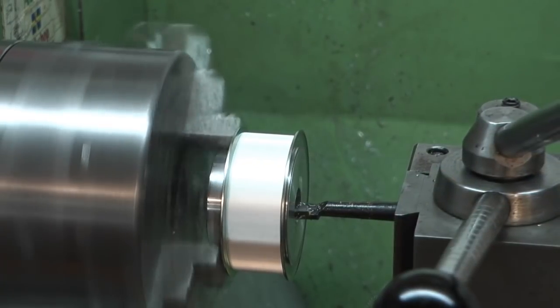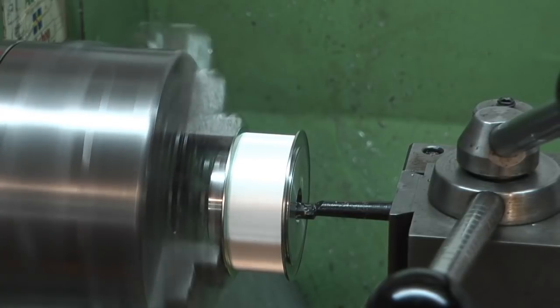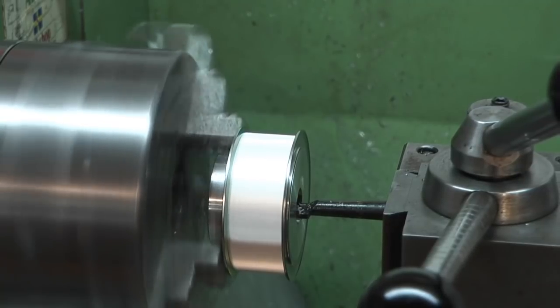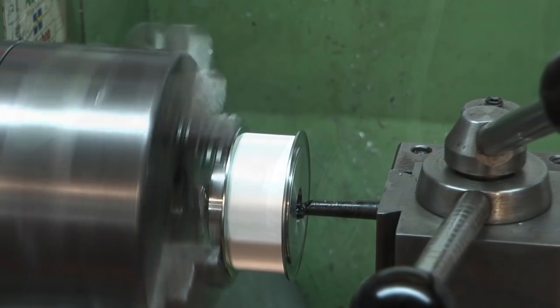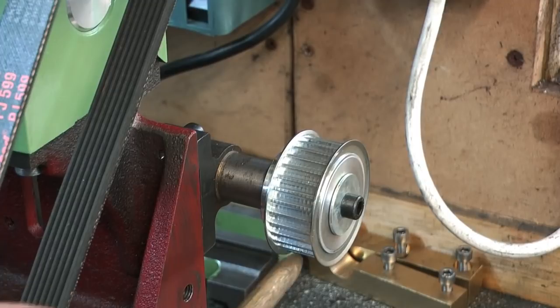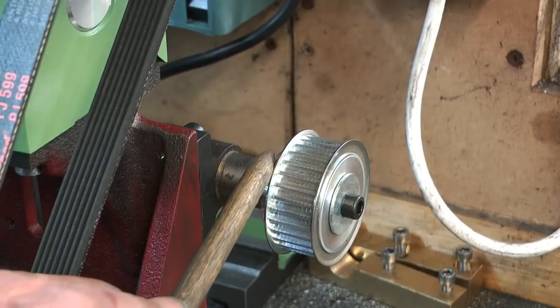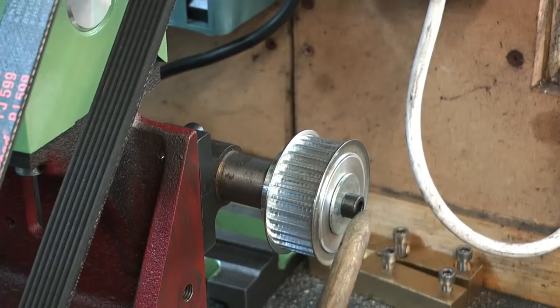So a little boring bar, another one of the little cam-type pulleys, and this is going to go on the end of the lead screw. I'm going to drive the lead screw with a stepper motor, and this should be a finishing cut to go through there at 12mm. I fitted the pulley up - it was a nice sliding fit on the end of the shaft. I've just put a little drill bolt and washer on the end temporarily. I'm going to drill a grub screw hole in the flange and the shoulder down into the keyway, and I'll put a bolt in the end and make a nice little aluminium spacer to clamp it all up solidly.